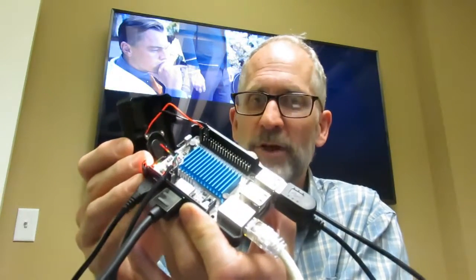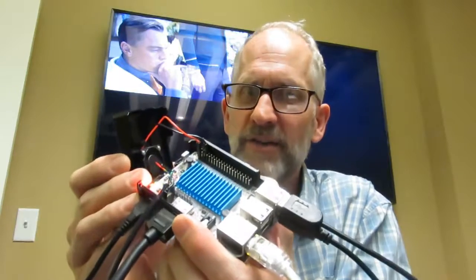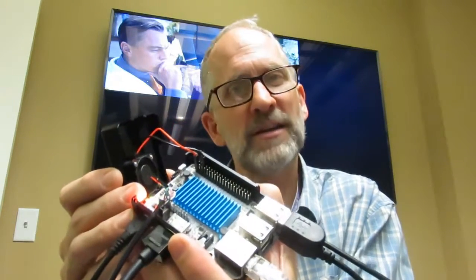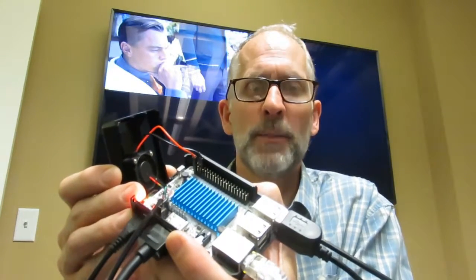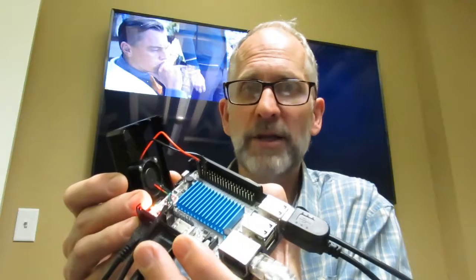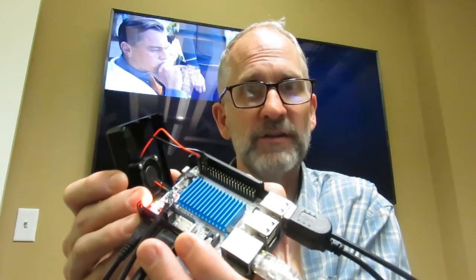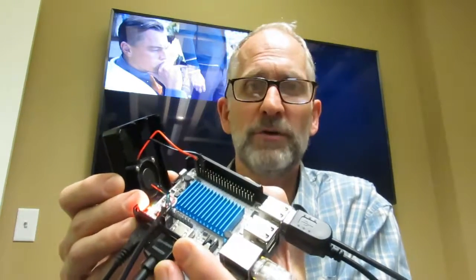We have also seen this running the latest Ubuntu operating system with a mainline kernel implementation, and enough of the device features implemented in the mainline kernel to support the basic computer operation and build tools, but not the special features for video playback, such as the video output pipeline through HDMI at 60 frames per second, and the hardware decoding capability, not yet fully supported in the mainline kernel.